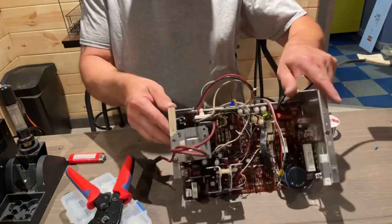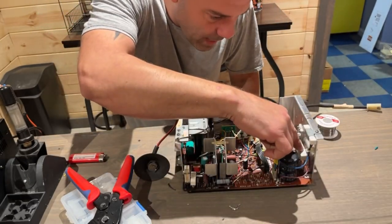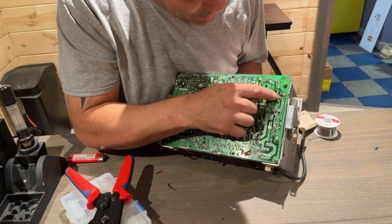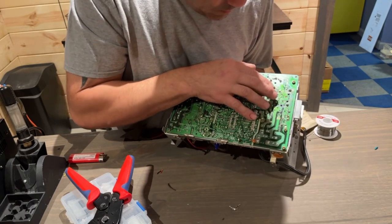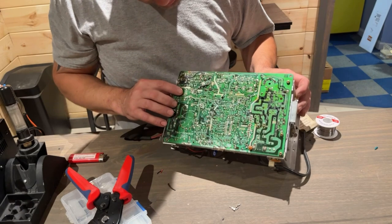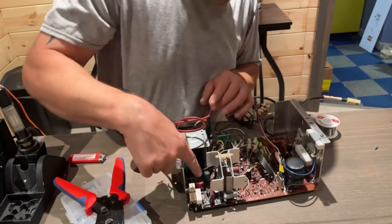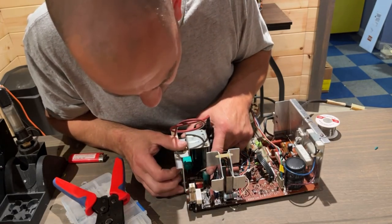Let me go grab a cap kit. I'll be right back. Somebody's done some work to this. Why is that just floating there loose? Huh, look at that. Right here. The pads are screwed up on the board. Completely loose. So I gotta fix that. Somebody recapped this whole thing. At one point, this has been recapped. But some of the caps are different colors, like this one right here. This to me looks like an old cap by the color of it. A lot of them do look new, but that one definitely does not look new, but who knows.